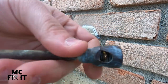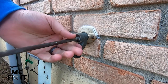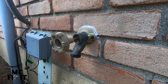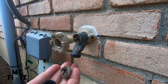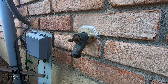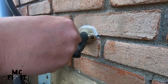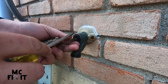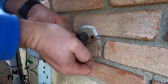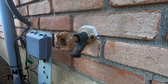You don't want to overtighten it, but you do want it to seat nice. You can see that screw seated pretty nicely. Go ahead and feed the stem all the way back in, put your nut in, and instead of the old fibrous packing material, the new one is much more plasticky. Take the new packing, put that washer in, use your screwdriver to push it back, slide it over, and push it back in. Be careful with the screwdriver — don't be too blunt. Push it toward the wall and screw it in just like before until it stops. That should stop the leaking as well.